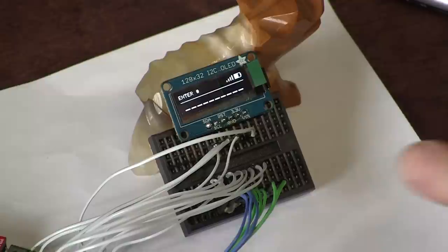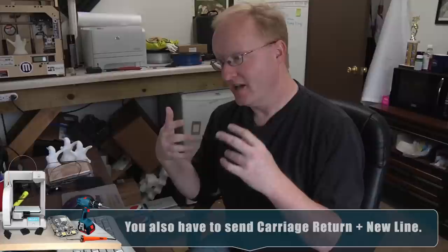I have this data sheet over here, which is basically all the commands for that phone module. If you want to make a call, you basically send via serial the characters ATD, then the phone number, and then a semicolon. So I'll take the string of text that's on the screen. It's not numbers, it's actually ASCII characters. Since you have to send serial data to the phone, you send it ASCII characters. So if you want to send a 0, you don't send a 0, you send a 48, which is 0 in ASCII. So let's try that part out next.